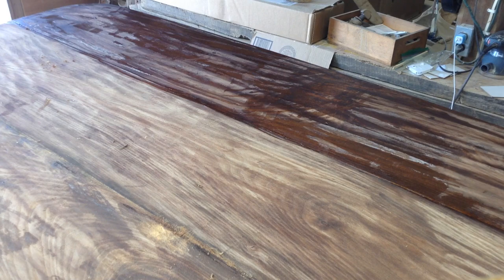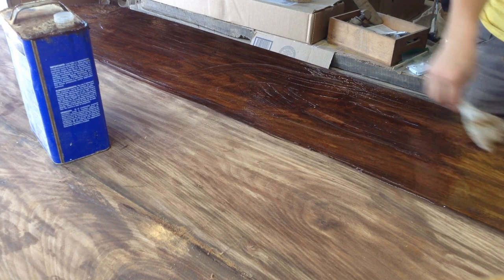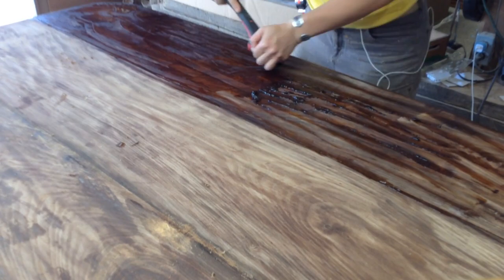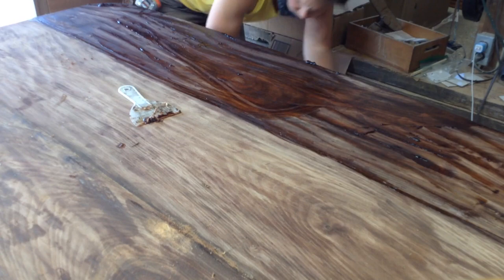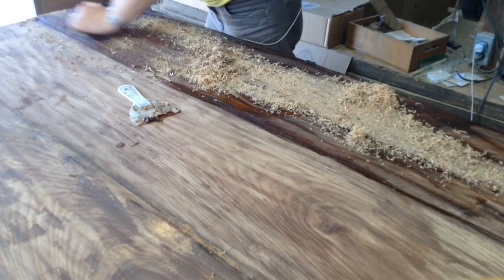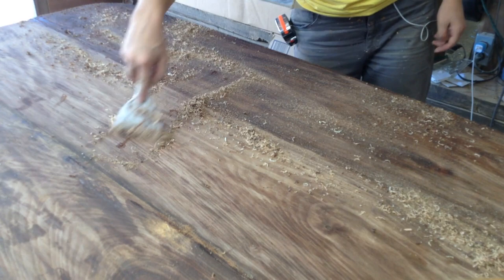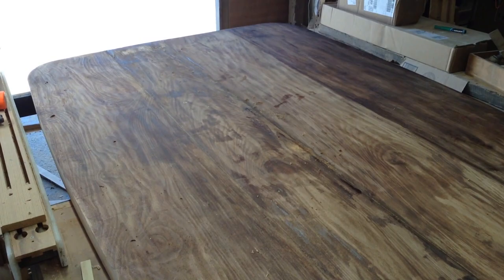Most of these pieces, even the base, I got away with two coats. Let it set up for about 15 minutes and scrape it again - that gets down pretty close to bare wood. Flat surfaces like this are super easy to strip because there's no detailing. Even the little groove detailing in between the planks was easy to get off. I put sawdust on there and that absorbs all the extra varnish and excess residue. Then I let this dry, because if you try to sand right away your pad will really gum up. I let this dry overnight before sanding.